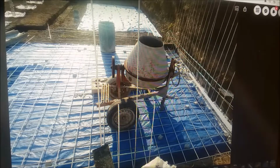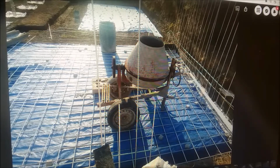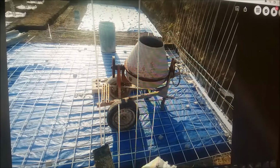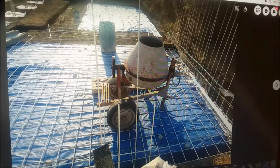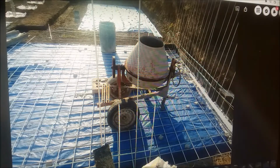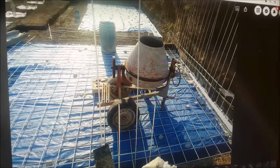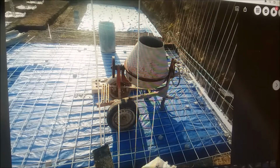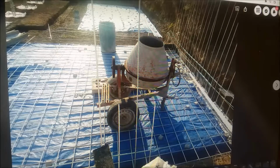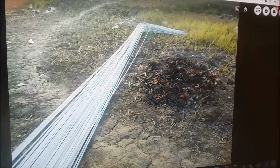So I'm going to bend, they call it break, some galvanized metal and make some, I guess you call them wave guides. One above the inverter and one below. So we suck the cold air off the floor, and then any heat on the inverter will heat the air, and the air will rise to the ceiling, and the ceiling is slanted so that it goes up along one edge, and then we blow it outside. All this electronics has got to be kept as cool as you can. There's ratings on it. We shouldn't be in trouble if we did nothing.